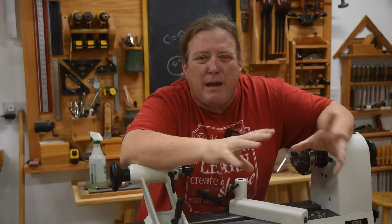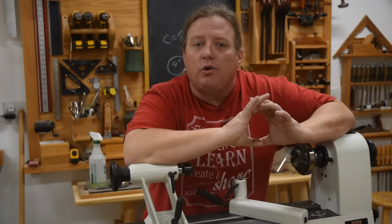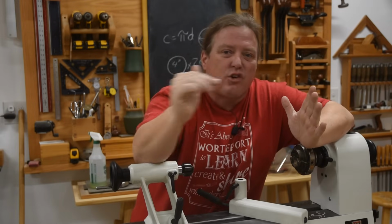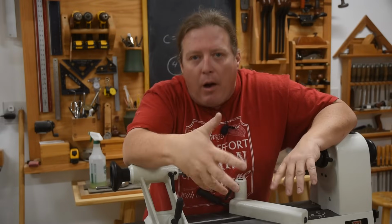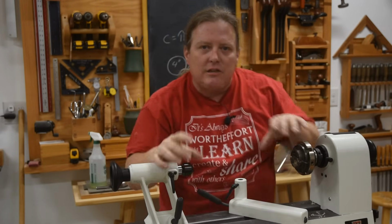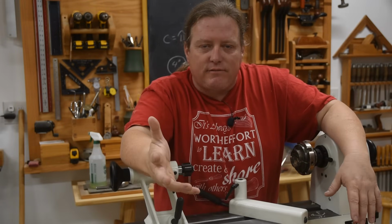If all you want to do is make boxes, well, having a bandsaw and a chainsaw opens up the opportunity for more material, but small boxes, you can get material from cabinet shops that they're throwing away. All those end cuts that have cracks in them that they can't use, a wood turner can use them. What other woodworkers throw away is our gold. And as long as you can get it in some kind of shape that's somewhat balanced, either a square or a rectangle, you can put it between centers, you can turn it. You don't need to get all that other stuff.